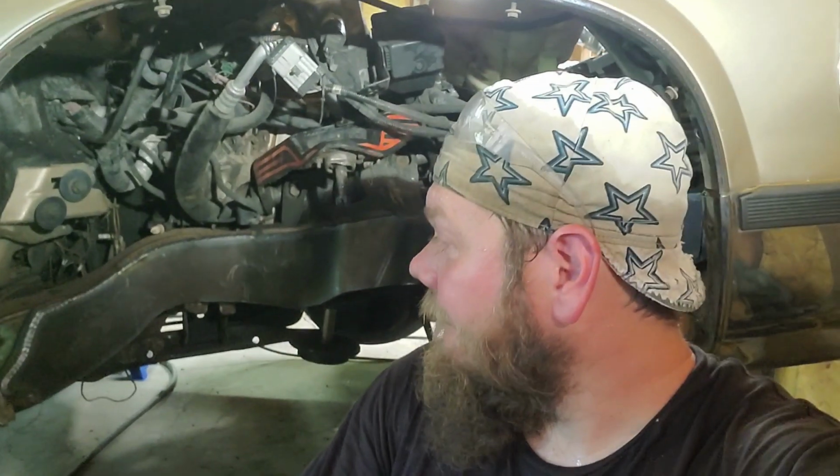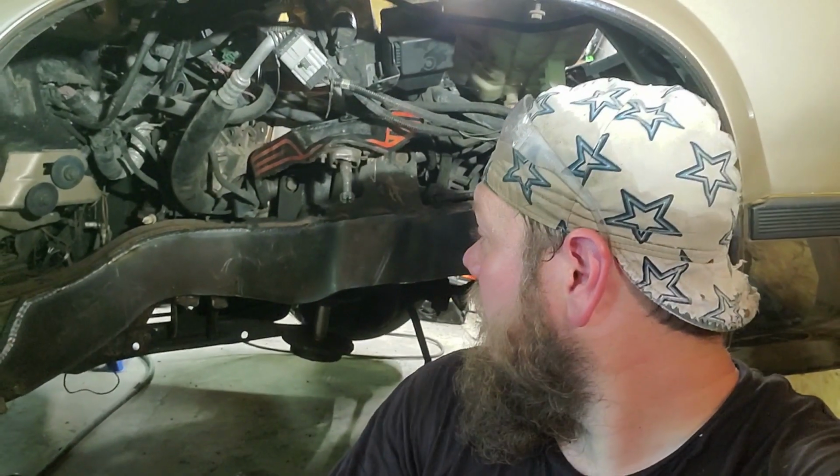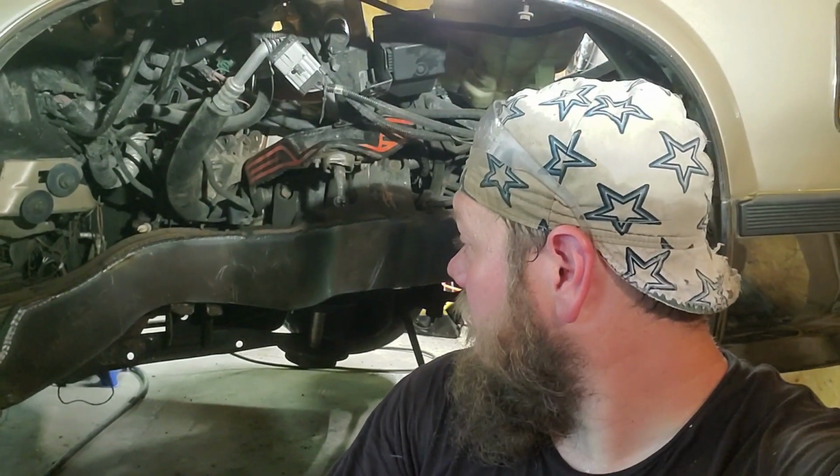I do know for a fact though that the ones on the front don't do anything as far as speed. So it's just ABS. Never had to lock down the wheels in the Blue Rose, so I don't know what it'll do, but you know, I'm a pretty safe driver. I keep a safe distance from everybody, mainly because I don't want my car hurt. But never had any problems with deleting the wheel speed sensors. So I'm not putting them back on this car, plus it's a cleaner look, no holes in the frame. Other than that, I'll let you guys take a look at it.